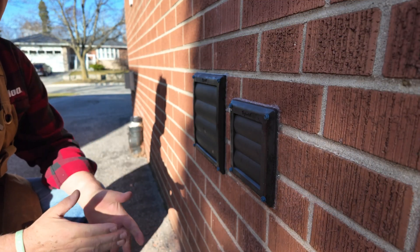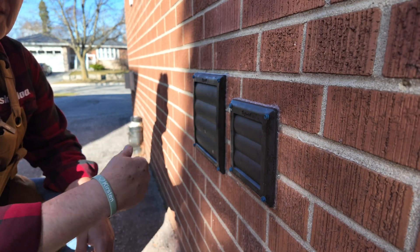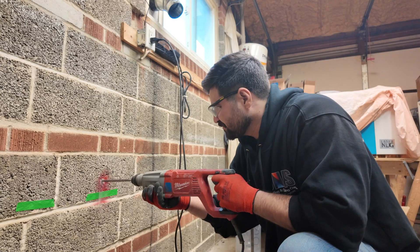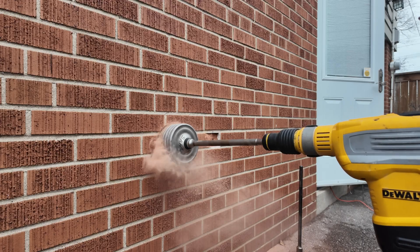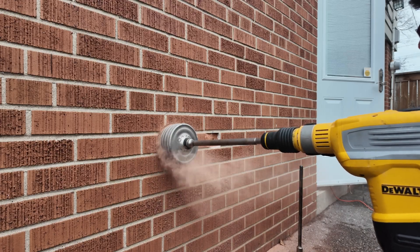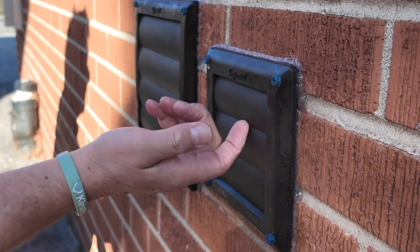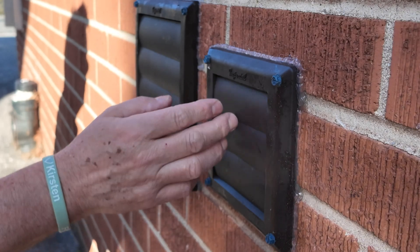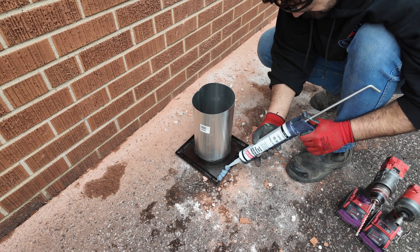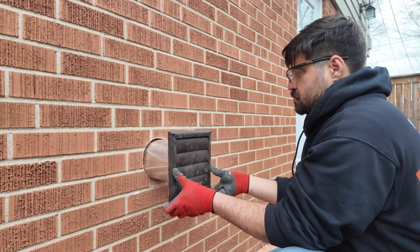It was time to up my game. I'll walk you through the new installation. Your contractor or HVAC technician is going to take a big coring drill and blow it through the outside of your house — in my case it's brick with mason block behind it. He's going to put the appropriate size hole for the appropriate size vent. This is my 4-inch, this is my 6-inch, and it's an assembly that comes with your outside hood — sometimes a metal hood shaped down with a damper underneath, or fins underneath. Once he does that, he's going to slide that plenum assembly in.